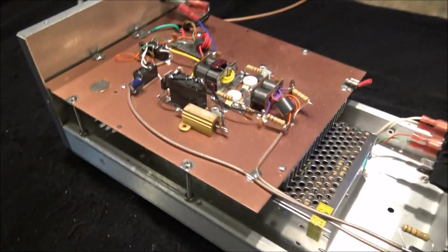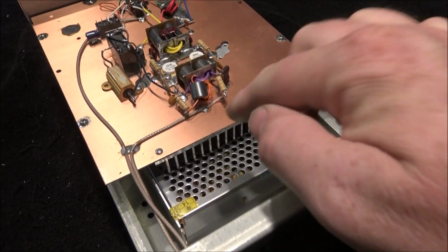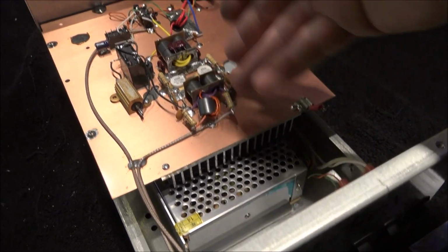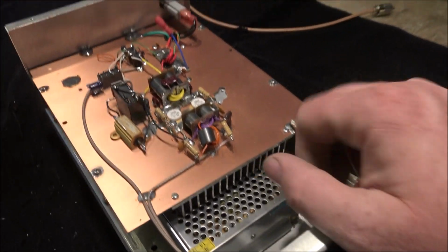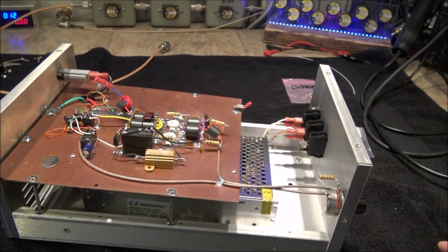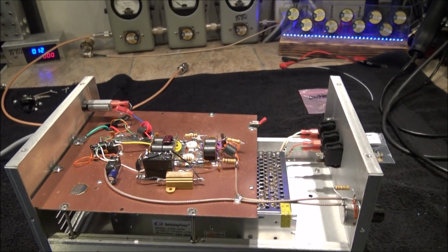So this thing's right. And because the heat sinks run this way, you think about it, you're spreading your heat zone across this entire surface area. Or if they were run this way, you would only be spreading your primary heat zone across 2 fins. This is a nice little design. This is really cute, but we are going to change a couple things on it. So, Sparky, here we go, buddy.